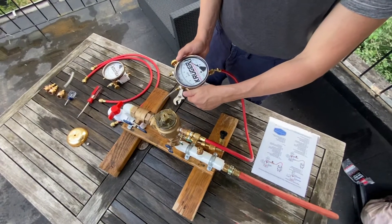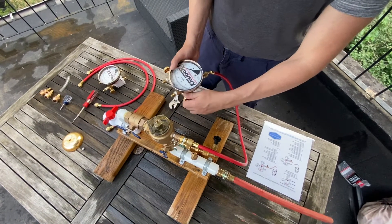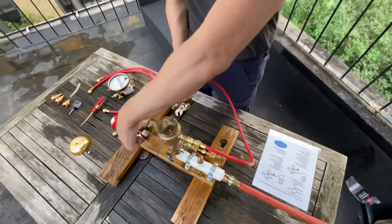Open test cock two — as you notice, the pressure goes onto the gauge. Open the high bleed valve and bleed the air out. Then close the high bleed valve and close shut-off valve number two.